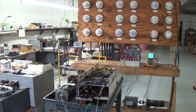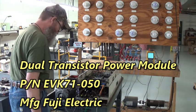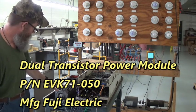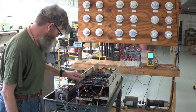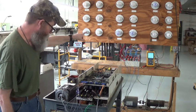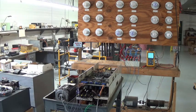Here's our spindle drive. I had the blown up IGBTs in the new leg. Here I've got a resolver from this IRT motor fed into 4CN here. Here's our control. We've got U, V, and W connected to the light bulbs over there. Let's fire this thing up and see what it does.